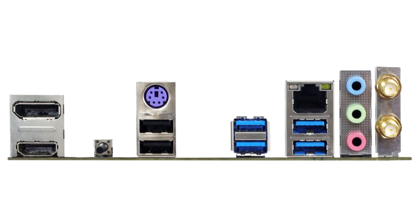The rear I/O also includes 4 USB 3.2 Gen 1 5 Gbps ports, a 2.5 Gigabit Ethernet jack powered by Realtek, 3 audio jacks, Wi-Fi antenna connectors, and a BIOS update button. Sadly, the audio side is once again utilizing the old Realtek ALC897 codec. Biostar has kitted out the VRMs with a heatsink, even though it's a very minimal one. Overall, Biostar has done a much more impressive job than MSI here, despite being considered a more budget-oriented brand.